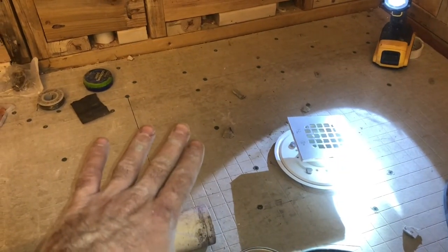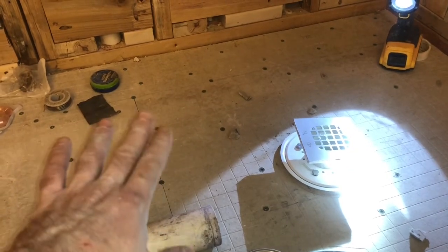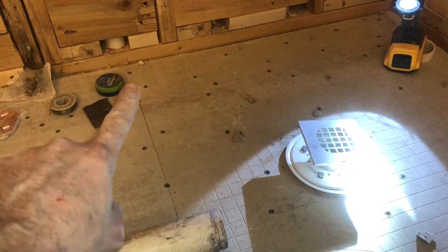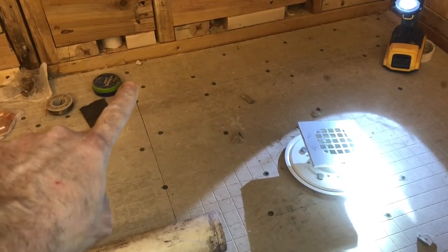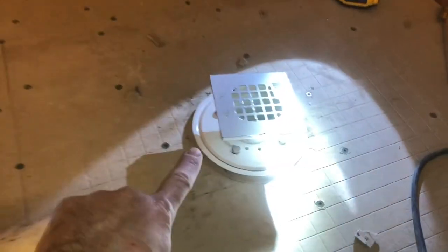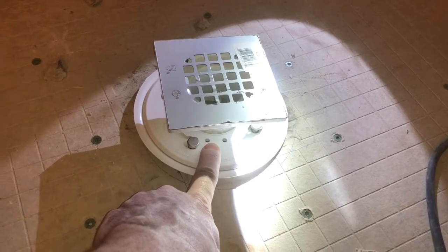Remember, your mortar is not waterproof. Remember that. Say that with me. Your mortar is not waterproof, because if you think it is, you need to understand that it's going to absorb the water and drain down underneath the mortar, come down this way, and it needs to get into these weep holes. If it can't escape, you're going to get a lot of cracking.